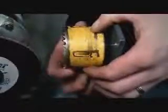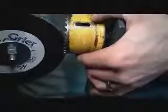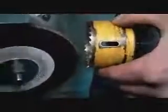So that way now you can pull it out, bring it in and turn it in and you won't go any farther. We should be ready to set up to do a little test. It looks like we're grinding pretty much perfectly in there — maybe just a smidge towards the back. If I bring my motor forward a little bit, you see how that hole saw moves, that will allow you to get into the outer edge of that tooth a little bit better.